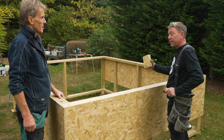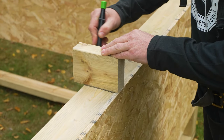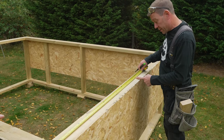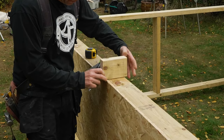This is the thickness of our end common king — 45mm. So that is where our end common is going to go. Now we're going to measure from the overall up to the end common, and that is 11.90. End common king will go there like that.